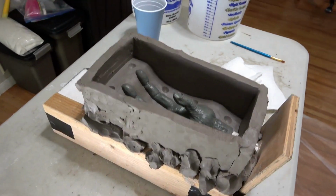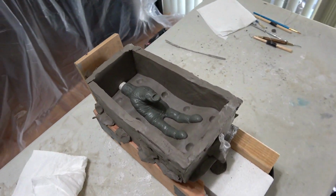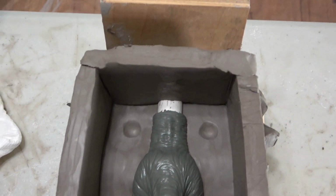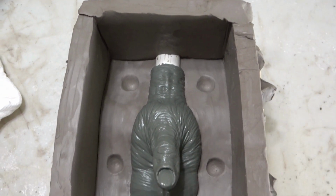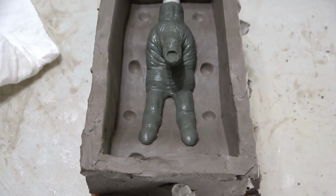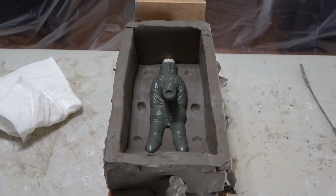Basically, I'll be creating a 2-piece block mold. The walls are about a ½ inch taller than the sculpture, so I can fill it up with hydrocal. The PVC will become our pour spout in the mold for when we're casting latex. And the thumb I specifically sculpted with no armature so that it won't lock into the mold. The majority of the hand sculpture will pull out of the mold first, and then the thumb will slide out of the mold separately.